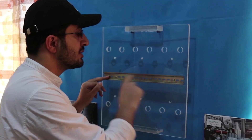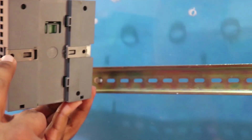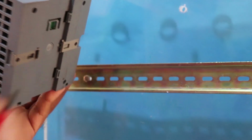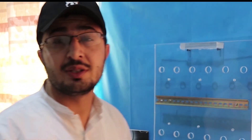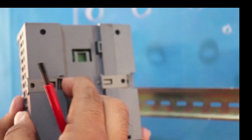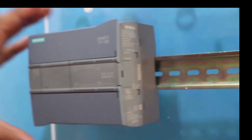This is our DIN rail. If you're wondering what a DIN rail is, it's a metal rail used for mounting circuit breakers and other industrial control equipment inside an equipment rack. You're going to see every component that will be installed and how these components share data and power with each other. We are going to install the CPU first into the DIN rail — we open this mechanical latch, and then close it to tighten the CPU onto the rail.